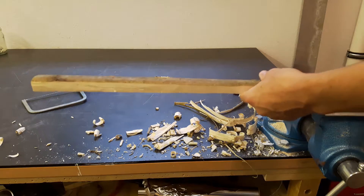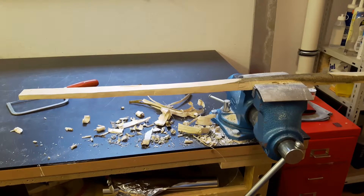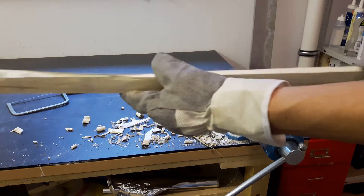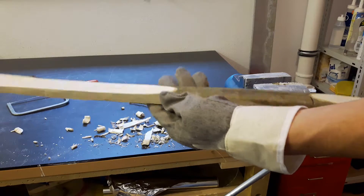The next thing that has to be worked out is the back section. There's a lot of wood and you can't bend the bow in its current state, so I have to remove all this wood. Now you can see the handle and the arms of the bow are becoming noticeable. The bow is pretty squared at the moment, so the next step is removing the hard edges and giving it a round back.